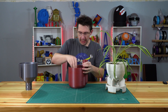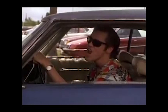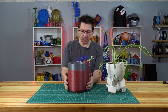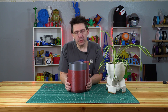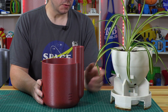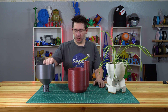Now the real test — now that we're getting out these little strings from the underside, we need to see if it fits. I haven't put it in yet. Oh, this is fantastic — look at that! The height is comparable, so it shouldn't be too big for where it's going. It's going to actually hold the water down there. We've got to see if it's watertight. The instructions say to use some Titebond 3, which is water-safe glue, to put in the bottom. But with three perimeters? This was watertight, and this had fewer perimeters except where the holes were. I'm going to say no to glue for now — if we run into issues when we add the water, then we'll add some glue.